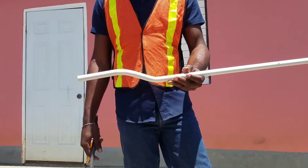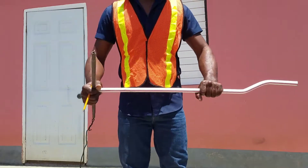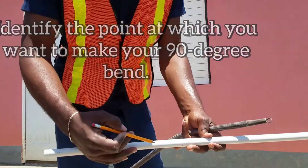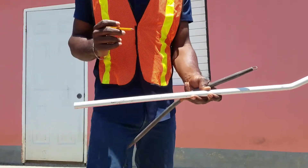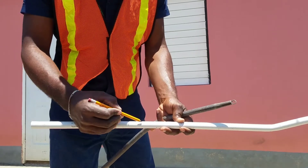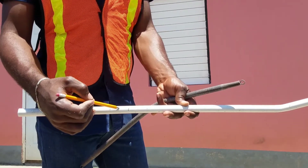Now, how to make a 90 degree bend with this 20mm conduit using the spring bender. First you want to identify the point at which you want to make your bend. We don't want our bend to be too sharp, so you're also going to make another mark at about two inches away on each side. This is where we initially want to start bending, and we create two marks about two inches apart on each side.